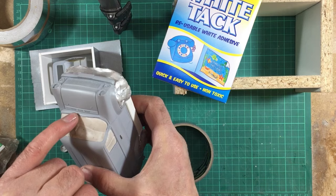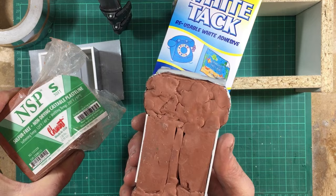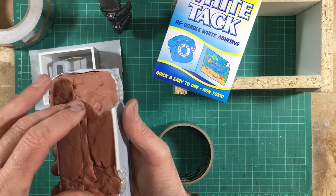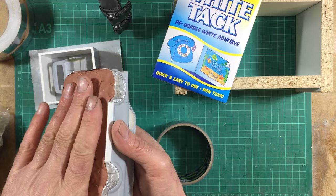And on the back of it, I've used this modelling clay. I believe they call it Chavant, but it's basically non-drying plasticine, and this is a soft version. So I've pushed a load of plasticine into the bottom of this body, and before I get too deep, I've run aluminium foil tape just around the very edge of the inside of the body to give me a wall. And then I've built the Chavant right up to the bottom of the model,